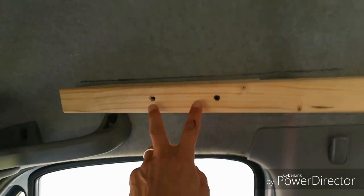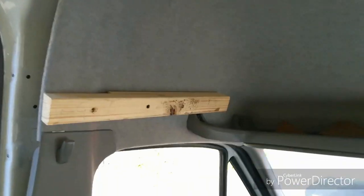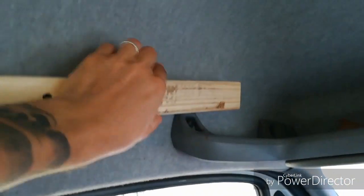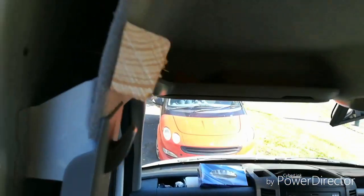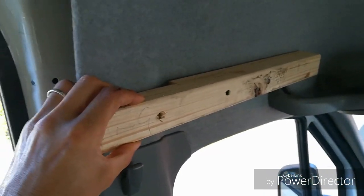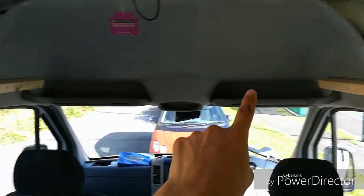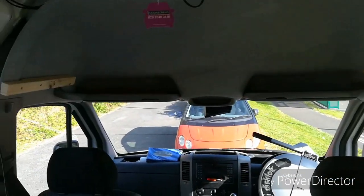Well, all I did was put the two screws through the timber, and same on the other side. Like I said, we've come down onto this point here. But also what Beck and I have just done: Beck held the pliers with a wall plug in, and we unscrewed the screw and then screwed back through into the wall plug. Bit of a backwards way of doing it, but it's now solid. So I'm just going to brace the timber now, two timbers, one at the back there, right the way across, one at the front, right the way across, and that's going to be our base.